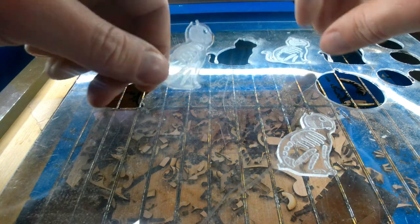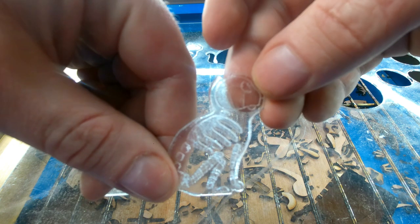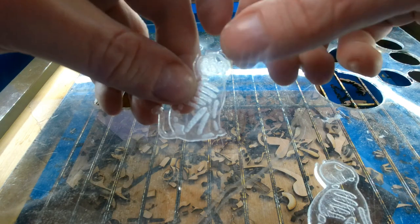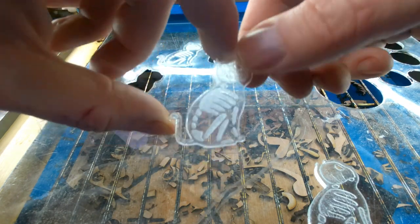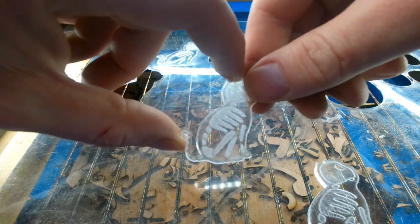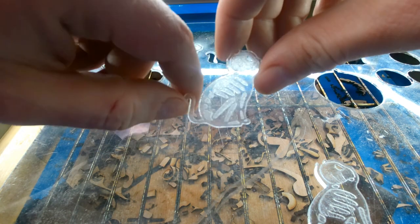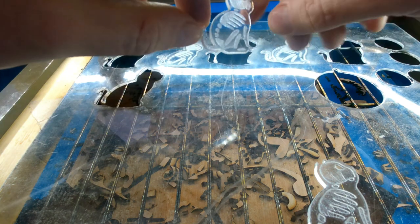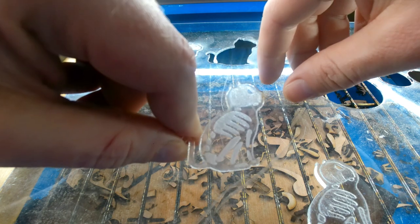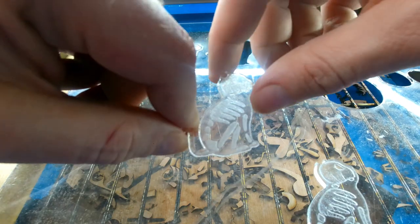I went through and tested several different things. This was one of the bigger ones that I wasn't quite happy with the engraving — it's a lot clearer but it kind of started to melt, and that was using a lot of power. This is basically the minimum power that I can fire on my machine, I think it's roughly around 8 milliamps before my machine even starts to fire — really low power and quite high speed. I'm going to do a couple more tests just to make sure I've got these settings dialed in, and then I'll move over to the 3mm acrylic and see how we go from there.